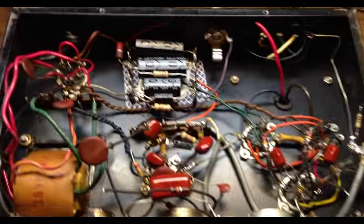I've had this thing open. I've been doing a lot of little troubleshooting, kind of chopsticked around with the thing open and on. Can't really seem to figure out what's going on here. I do have a couple of unusual components that are becoming somewhat suspect to me. Here on the filament circuit, these are the filaments. But right here, here's the center tap for that winding. This is the 6-volt winding. It goes through all these filaments.